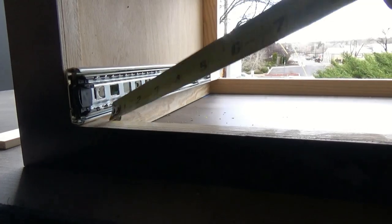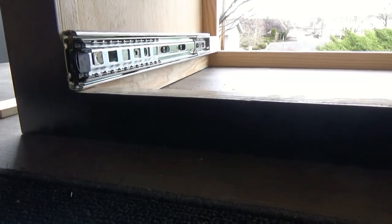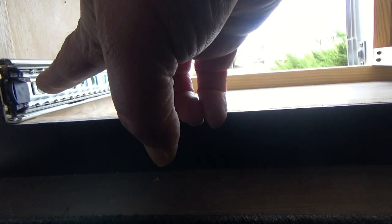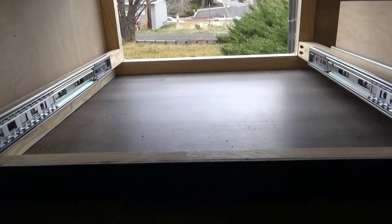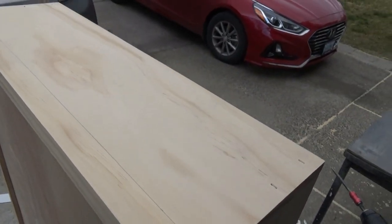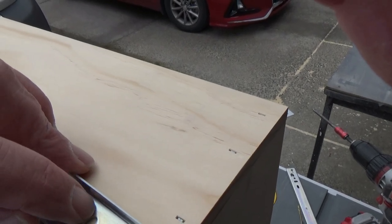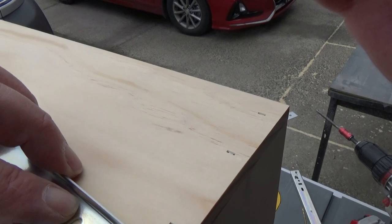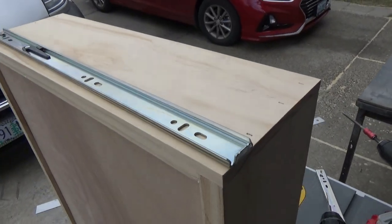The drawer slide is just sitting here on the bottom. We measure up — looking about an inch to the center. To raise the drawer up, I'll measure up from the bottom of the drawer seven-eighths of an inch and then drop it probably another eighth of an inch, so I'll have a quarter-inch clearance on the bottom just like the rest of them. I have my line on here at seven-eighths. I'll take my slide, put that on, line up the top of the line with the top of the oval hole — that drops it down about another eighth of an inch — pre-drill my holes, put in three fasteners, and test fit it.